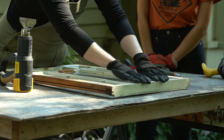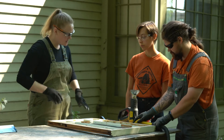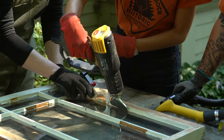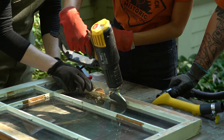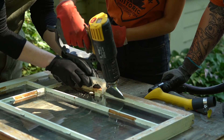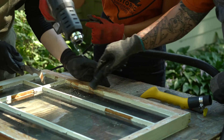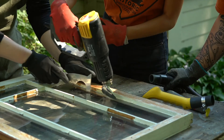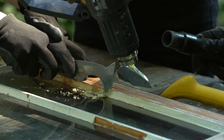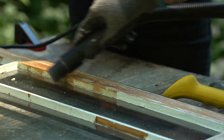The next part that we will be demonstrating is glazing removal. Usually what I like to do is kind of do a first run of removing it, following along this edge, being very mindful of this straight edge right here. I always say you never want to go inward — you really just want to use this edge to guide you along, because this edge is what we're going to see. We want that to be nice and straight. One of the reasons you want to make sure you're vacuuming as you go is also to avoid potentially scratching your glass.